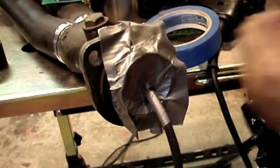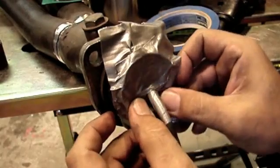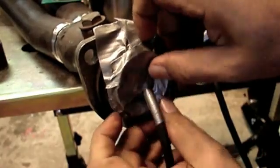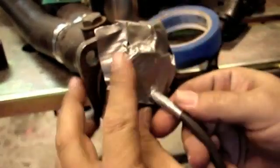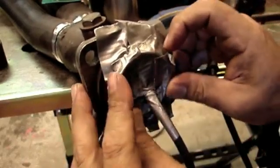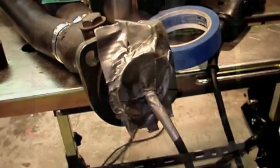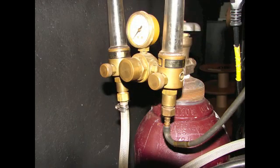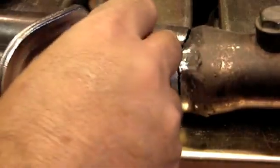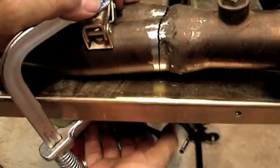On the inlet end, I'm using regular duct tape because it seals well. I wrap it around the purge hose first to make it tapered, then cut a hole and pull it back through — it makes a good seal with a little bulge. Then I touch up the taping and turn the purge on for a few minutes. I'm just using vacuum hose line with a barb fitting off my dual flow meter regulator. It's probably not ideal for stringent applications like titanium, but it works great for most things.